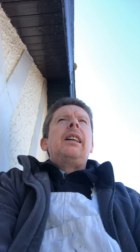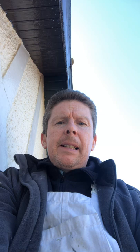All the fascias, soffits and downpipes are going dark brown gloss. At the minute I'm using Crown oil-based charcoal grey undercoat. All it basically needs is a clean — there's not a lot of loose paint. I scrape down, sand, undercoat and gloss — that's all this job really needs. I started yesterday and I'm kind of halfway around the house with the fascias and soffits. If you can see in the background, the soffit here is all undercoated in the charcoal grey. Then you have these wee borders — they're all getting done in cream gloss, I think it's Magnolia. They've all been lightly sanded, ready for just a white undercoat and a coat of cream gloss.